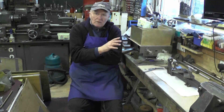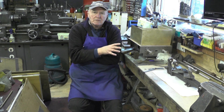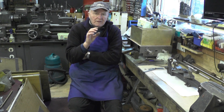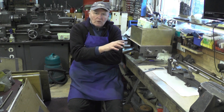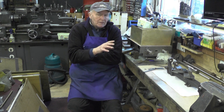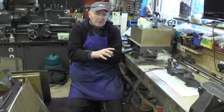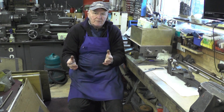In this part I'm going to get all that very, very light surface rust off the castings, and the few components that the initial owner did many, many moons ago. I'm going to get all those cleaned up, and then my first job once I've got everything cleaned up, I've got to make some gibs for the slideways just so I can get all the slideways working. Then I've got to move on to everything else - everything else I'm making from scratch.